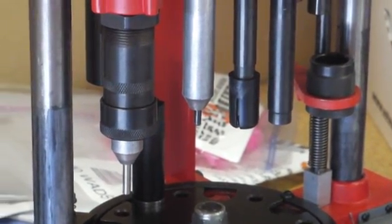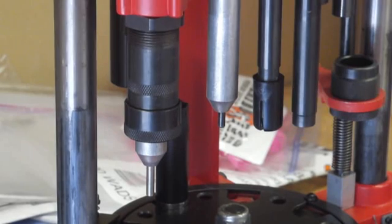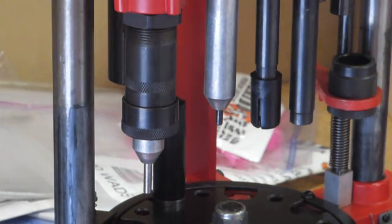So now we're going to go to pre-crimp. This is where it starts to close the fold. And the thing with pre-crimp is that the tighter it is, the smaller the hole is, the more material you're going to have for the crimp, and it's going to be more closed. And that might be one of the reasons Steve has some of those open crimps that he has, because his holes, from what I saw in the video, that's a pretty big hole in them. So anyway,